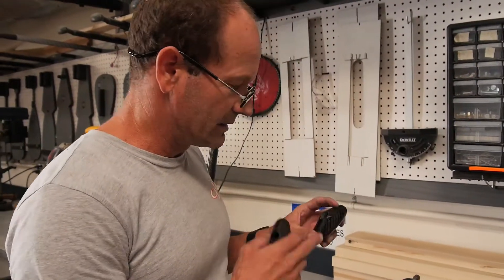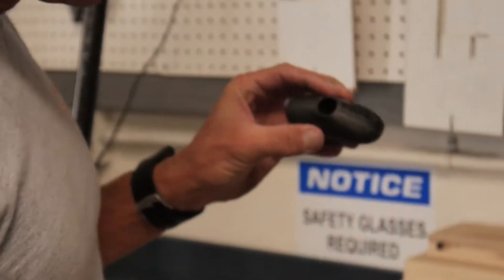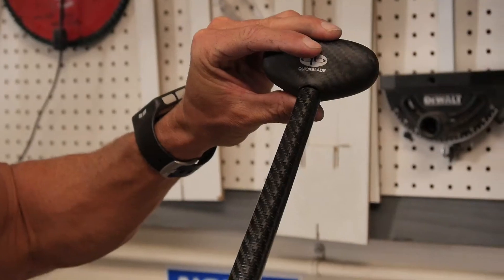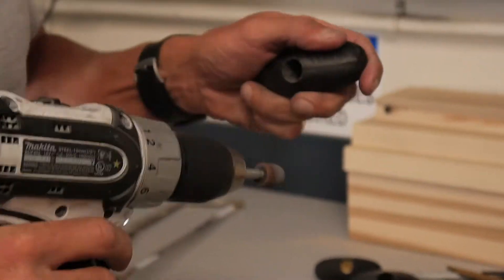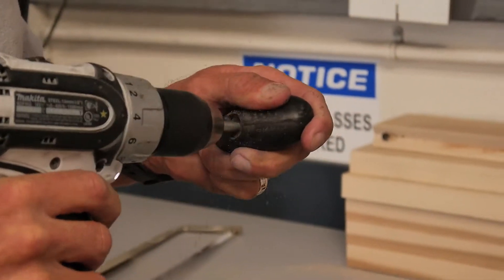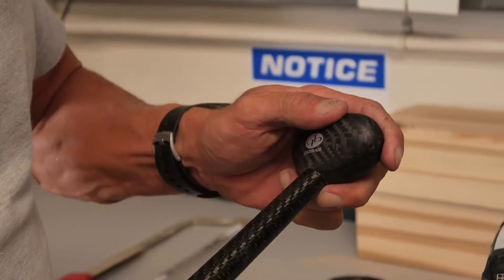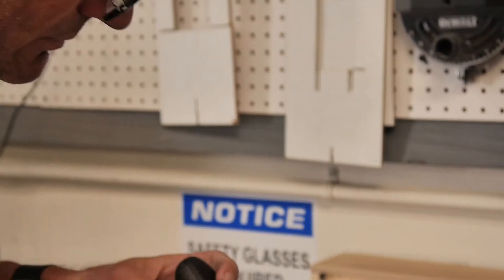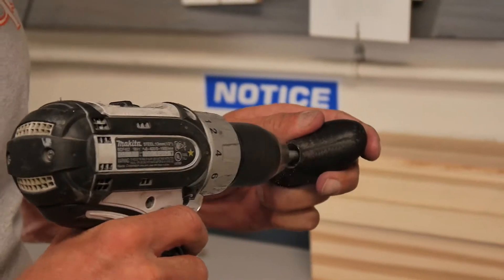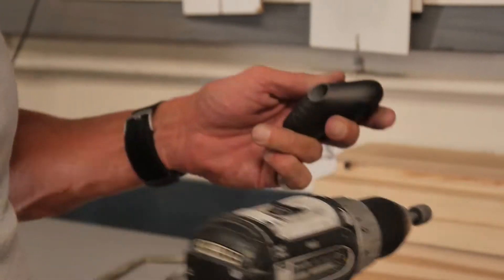Another option: if you don't want to take the time to save your original handle, you can purchase a new handle from us. This handle has a .650 diameter hole, and you can see it doesn't quite mate with the original shaft, so we still need to open it up just a touch. Take your time and open it little by little so you get a nice fit.